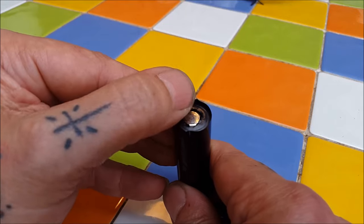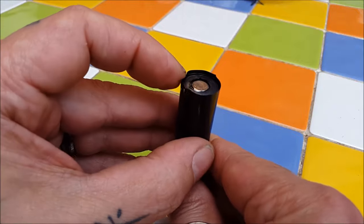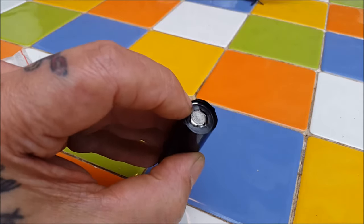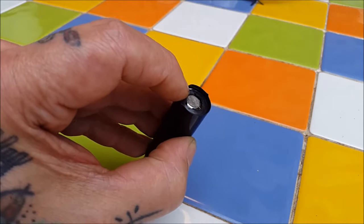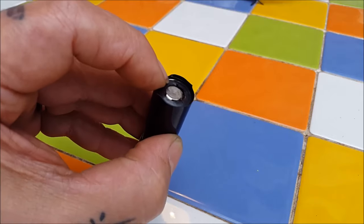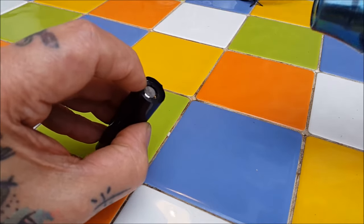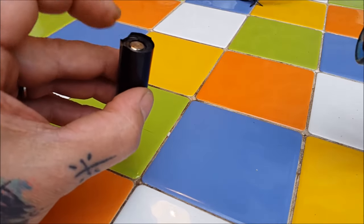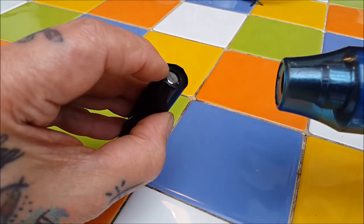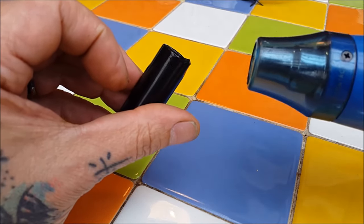That's all good and ready for a shrink. I'm going to use my heat shrink gun — use your other half's hair dryer, use your hair dryer if you use one, we don't judge. Don't use a blowtorch, don't use anything that gets too hot — remember you've got a live battery in your hand and if it overheats it's going to vent, you'll ruin the battery and you might hurt yourself. Trap that little safety cap, push your finger over it, and go in and just start to shrink it — see, it's gone crisp. That'll hold it.